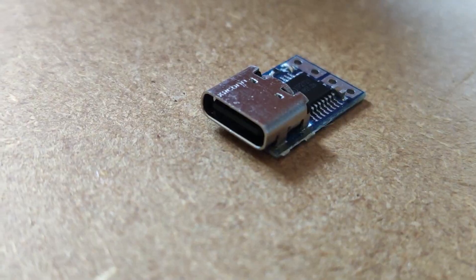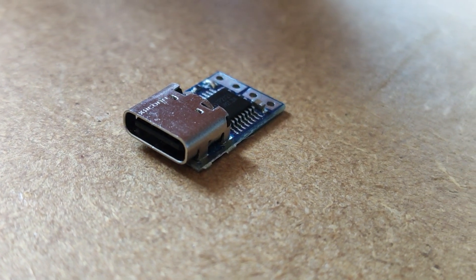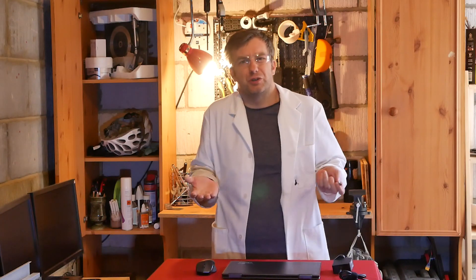If you follow this blog, you know that I complain about gadgets without a USB Type-C port, or give extra marks in reviews for gadgets that do come with USB Type-C. Why? Because we should have made the switch a long time ago. USB Type-C is backwards compatible, meaning you can put the port and still operate it with a USB 2.0 specification. The manufacturing reason that holds it back is that micro-USB is less expensive and easier to integrate into existing circuits, because USB Type-C needs special circuitry to operate correctly.